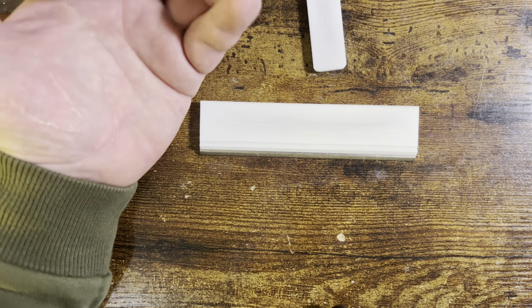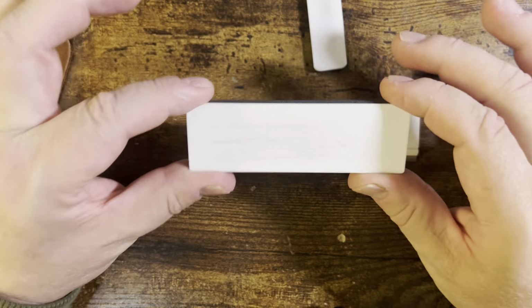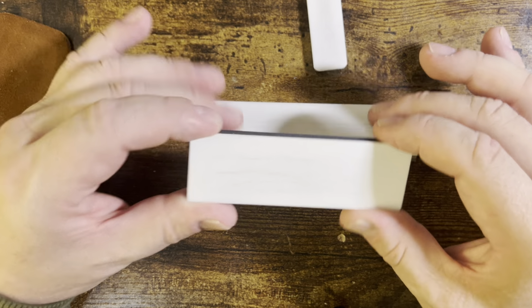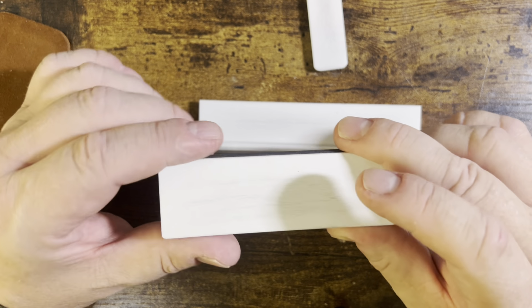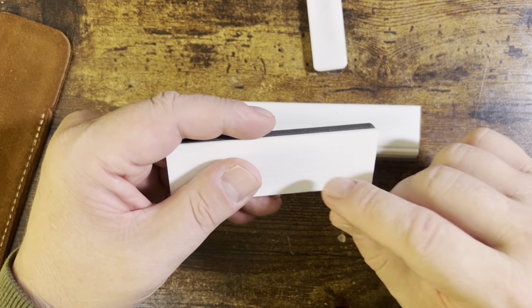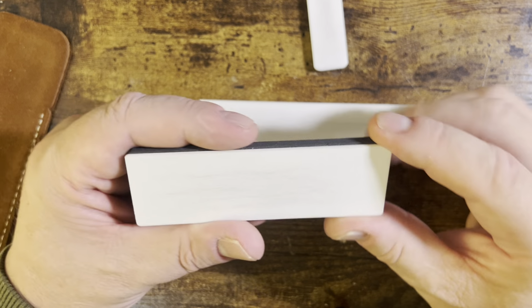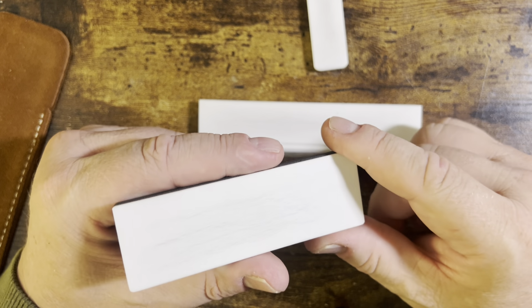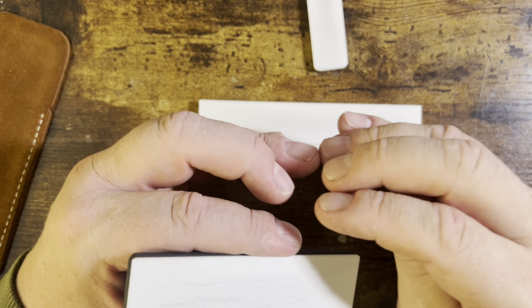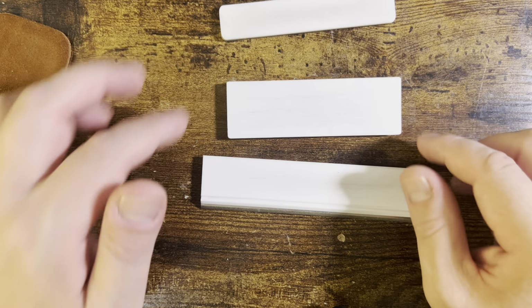And as far as touching up something that's already crispy and dull, any of these do a fantastic job of that. The vitrified ceramic is one of the better materials, and this is white alumina, vitrified white alumina. Essentially, it's been cooked past the sharpening stone stage to where it starts to get glassy. These things start to kind of melt into an amorphous solid and melt together. It not only fines up the grit a little bit, but it also tends to make a smoother surface that's not a bunch of little grits, but kind of more wavy instead of rough things all crammed together. There's a lot to it, but it's fun to learn.